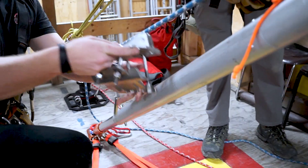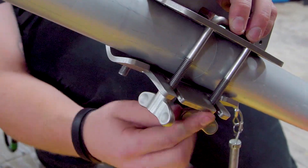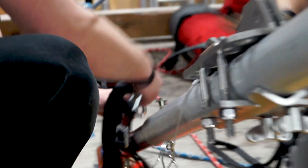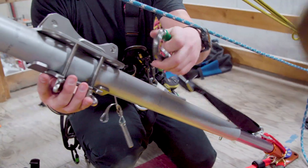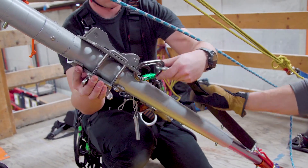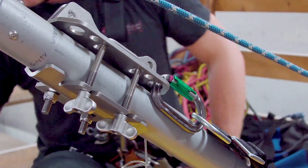The mounting plate is a clamping style compression plate. It'll fit anything up to a three-inch diameter. Once the clamping mechanism is adjusted to the diameter you'd like, everything is controlled by wing nut to snug it in place. We're going to back-tie the plate to the foot of the tripod or to another stationary anchor to keep the plate from chattering up the tripod leg once there's a load on it. The clamping mechanism is a positioning mechanism, whereas the full-strength anchor comes from the strap — so the strap is your actual anchor, and the clamp provides spatial positioning along the leg.